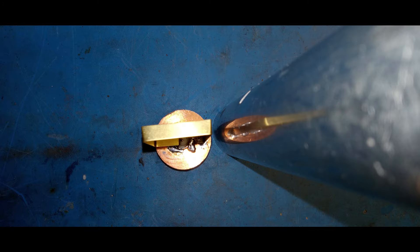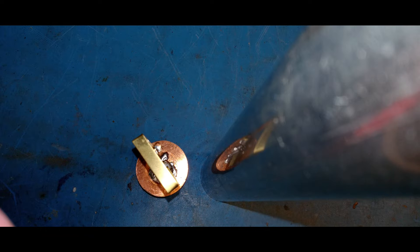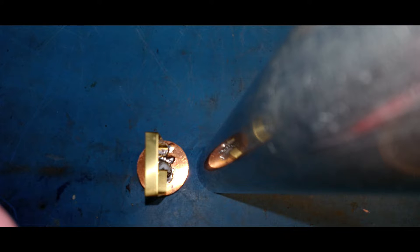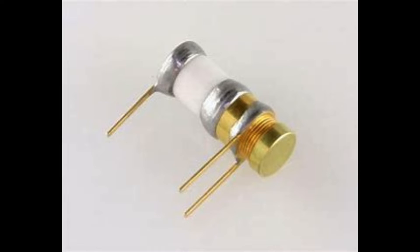The hybrid ring resonator cavities that we have used rotatable top mount coupling loops, but the coupling loops were grounded and would need to be replaced or modified to have the variable capacitor and make them tunable.